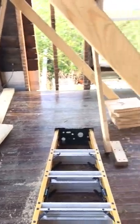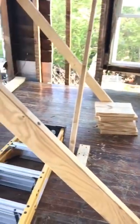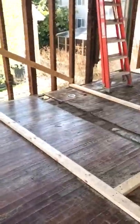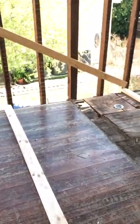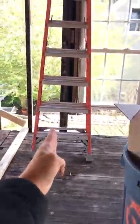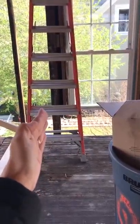This is incredibly narrow — only about eight feet eight inches — which we don't think is wide enough for a nice adult bedroom. So why have two small bedrooms when you can have one small bunk room for the kids and make this a more gracious size? We're going to push everything back one stud, which buys us about 16 to 18 inches. The bathroom shifts over a little bit, the mudroom starts a bit later — yes, we lose a spot for a dresser here — but by sacrificing that dresser spot we get a nice big front room that's basically as large and nice as the back room.